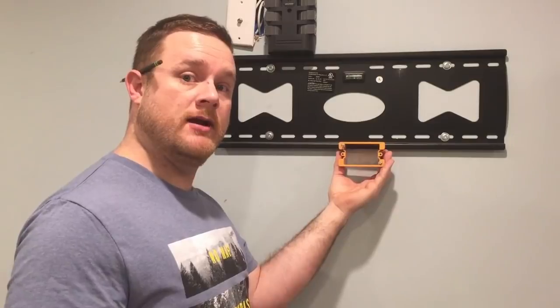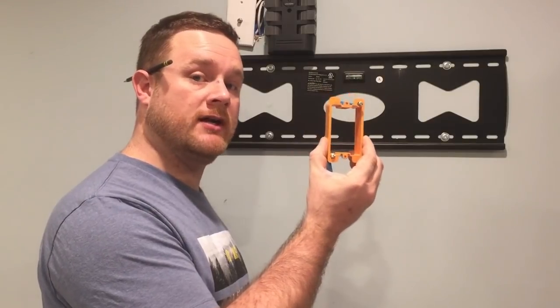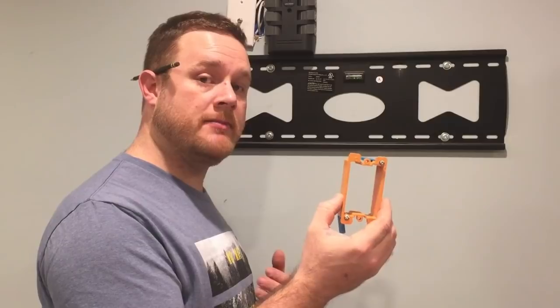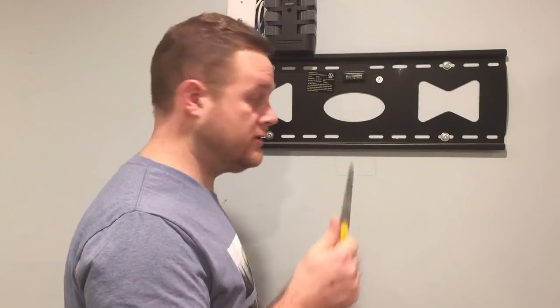The box behind the TV I like to mount sideways — that way you've got more room for your wires to line up side by side. When I get down to the lower box, I'm going to mount it at the height of all my receptacles and vertical like a receptacle. It's a little more difficult to manage the wires through it that way, but it looks nicer if you move the cabinet away. I couldn't find my keyhole saw but a sawzall blade works just as good.